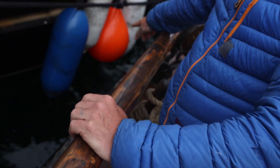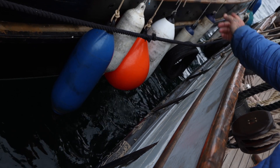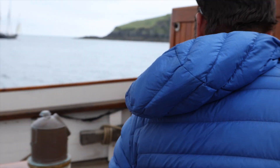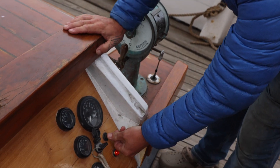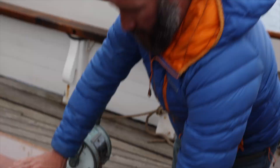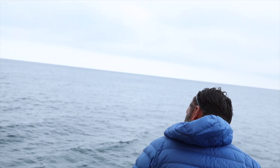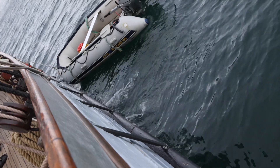Just down the side amidships, you can now see that water is running through the engine — that's raw water. Let that run for a minute to make sure it's flowing. Now we do the same process for the starboard engine — push the button, she's started up. We look down the starboard side and the water is flowing through, so we know the engine is getting cooled.